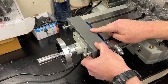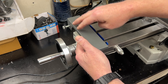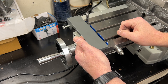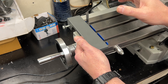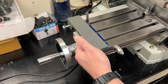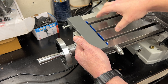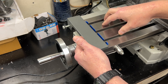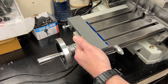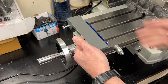The second thing I don't like about this: when it's fully installed and you have it as far over as it's supposed to be, we can't get T-nuts out this end. If you've got the vise on the bed, you have to remove the vise or leave T-nuts in on this side all the time, and that's going to collect chips and other things. It's really nice to have access to this side to slide T-nuts in.